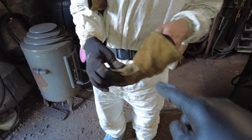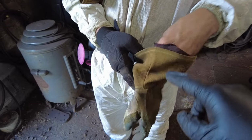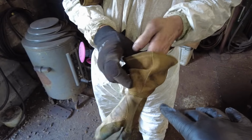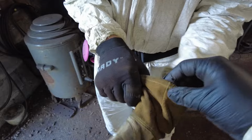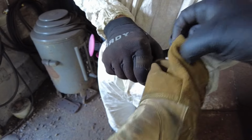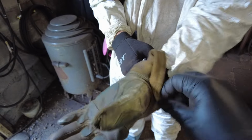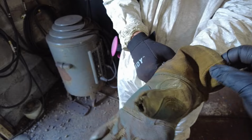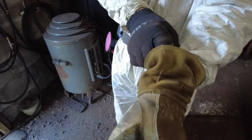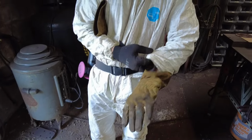This other option has one of these gloves stuffed in a much heavier leather welding glove. Now, this is less preferred. This up here is less preferred. It would be better if this cinched up nice and tight, because it's the looseness of this that can grab and pull you into machinery. Again, keep your arms out of it. Don't hug the spinning drive shaft on a buffer.